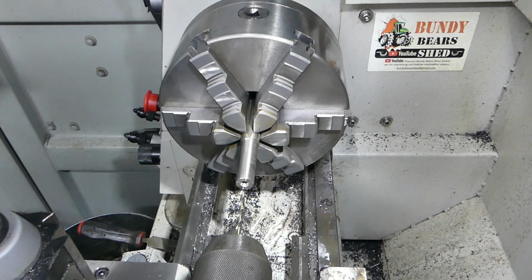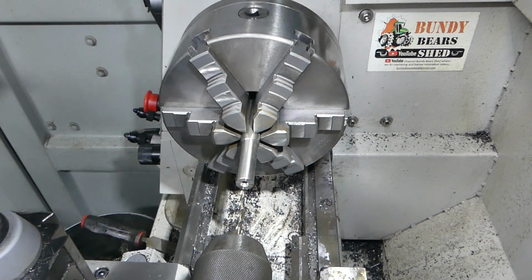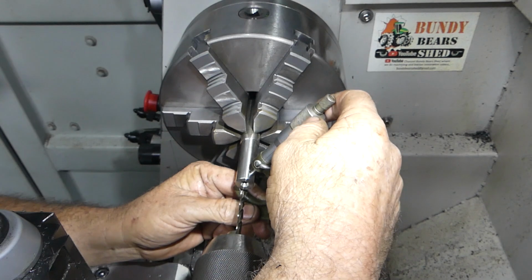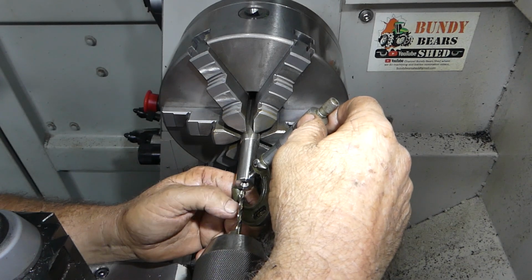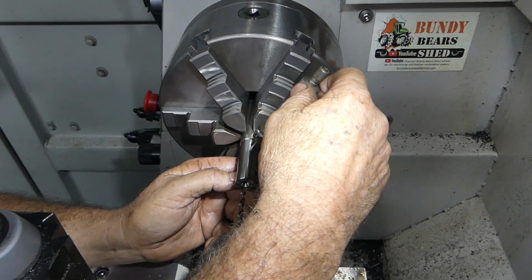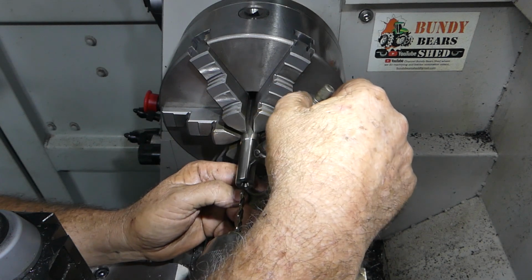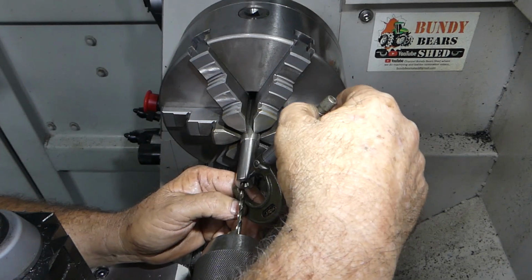Okay. So what was I running that at? Low 3, which is 240 RPM. I can't touch that just at the moment, but that's okay. Now, let's just measure it while it's hot and see what difference it made. Look, just for interest's sake. Oh, about 6.59 1/4. 6.59 1/2. 6.59 a bit. Yeah, very little difference.